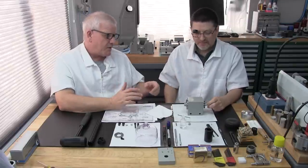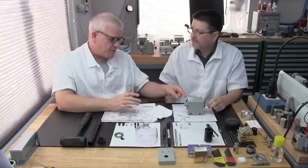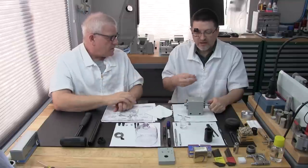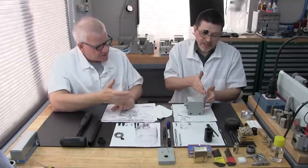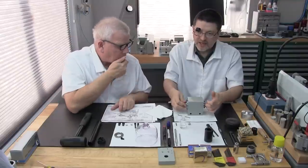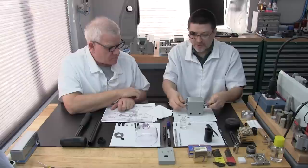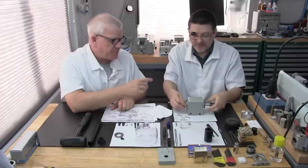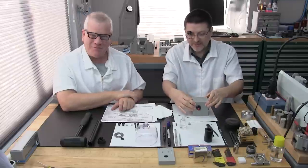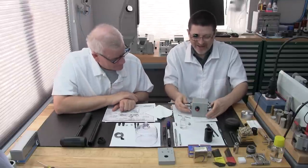It would have been either from putting that deep groove bearing in the back, or it could have been your locking collar, because it could be rubbing on something. If you didn't feel it by then, tightening the spindle nut is just going to amplify it. But it feels great. No binding whatsoever. So if you're feeling what we're feeling right now, you're in a good place. You'll be happy, smiling like the two of us. So there you go.